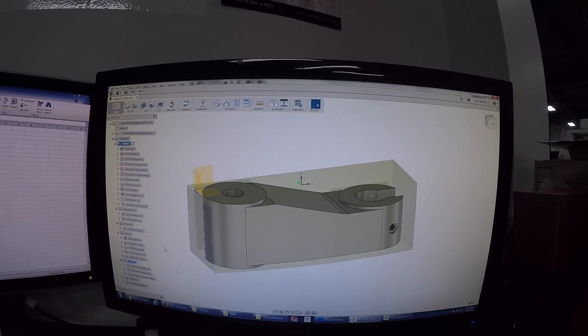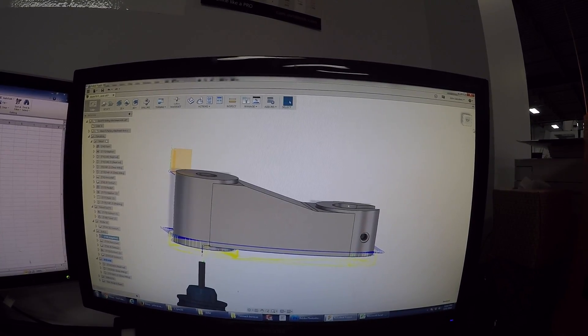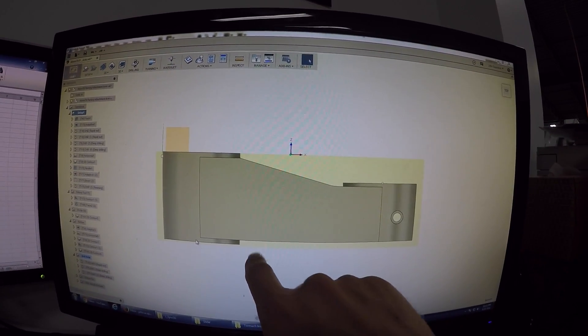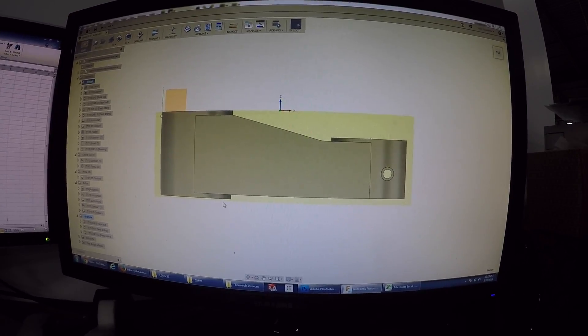Keep in mind we're using a machine that is not one you would buy or invest in to profitably make these in production. If I had to do it again with a bigger machine, I'd definitely buy raw material that's thicker — that way we'd never have had to flip the part. You'd hold the part with more excess stock on the bottom and then do the full profile in one fell swoop. Way better way to machine this part, and the extra cost of raw material is negligible.